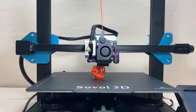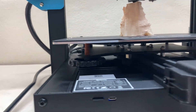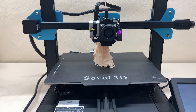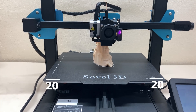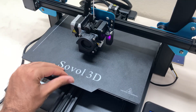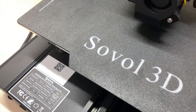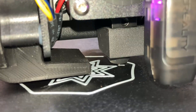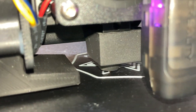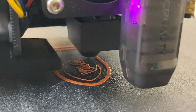Usually we see a square bed on most printers, but here it's rectangular. The 280mm X-axis has to do with the fact that the gantry is fixed from the side and not from the bottom — there's a 40mm extra space added to the bed, which is the width of the vertical extrusions. We also see a magnetic flexible surface as the printing surface. It's not PEI, it's slightly rough and quite flexible, and very good at sticking, so warping usually doesn't happen. This surface can also be replaced with a PEI sheet.